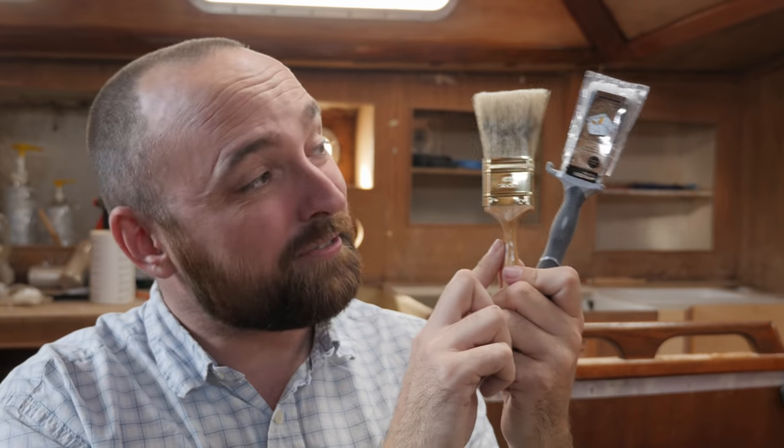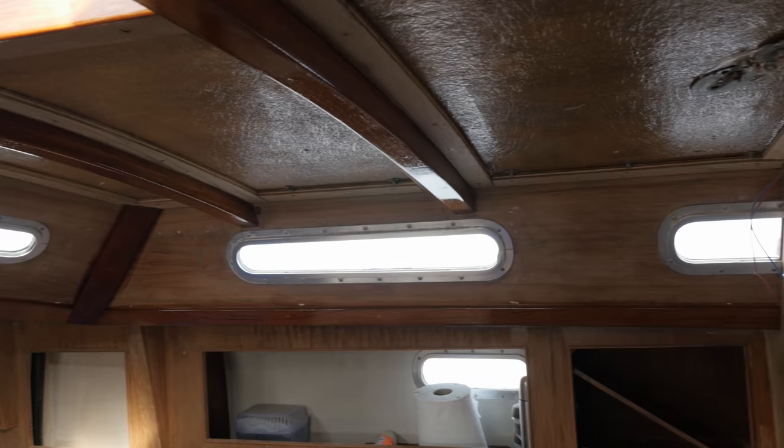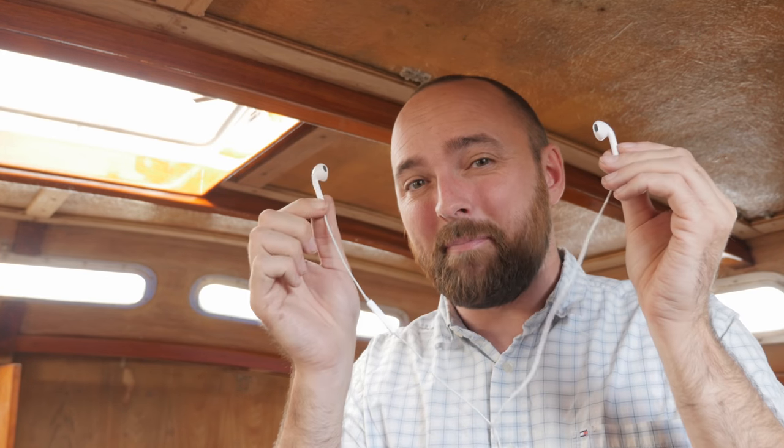The third thing is that it's really easy to take care of and clean your brush, so don't be afraid to spend a little bit more money and get a good quality brush that won't leave its bristles behind on your freshly varnished surface — because that is really annoying. When you're done varnishing, just use a bit of mineral spirits to clean the brush, and store the brush in paraffin until you need it the next time — just remember to clean it before using it. The fourth and final thing I've learned is that sanding between coats is crucial. I always use some 320 grit sandpaper — the wet kind. Sanding lets you remove any mistakes, be it a bristle stuck in the varnish or a run, but you also get to smooth out the surface so you get a nice smooth finish. Perhaps the fifth thing on my list should have been: remember to bring some music.